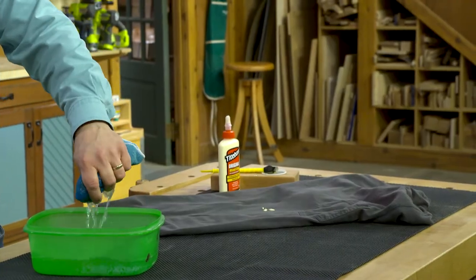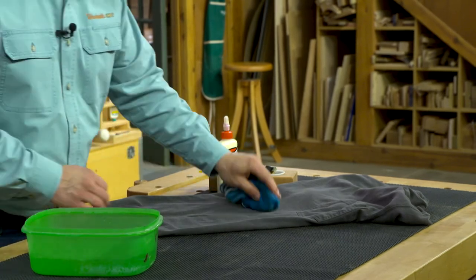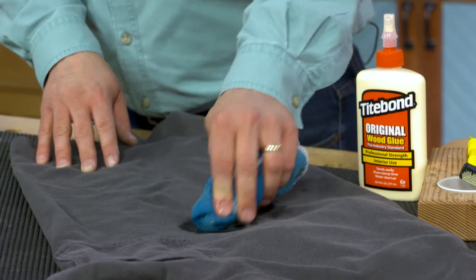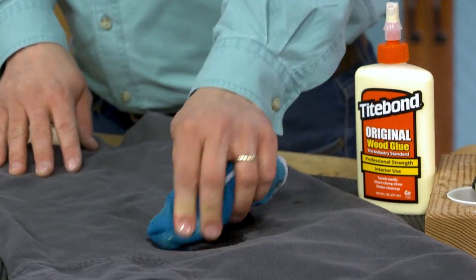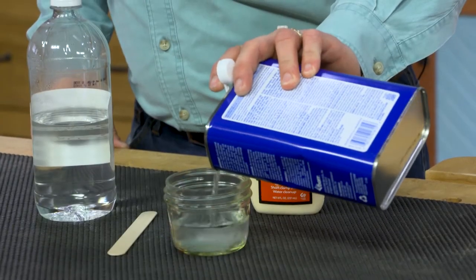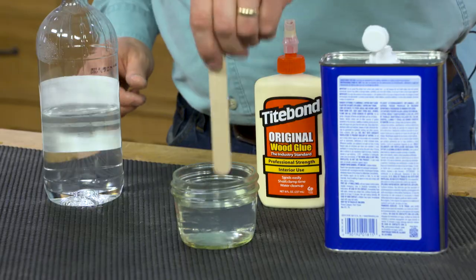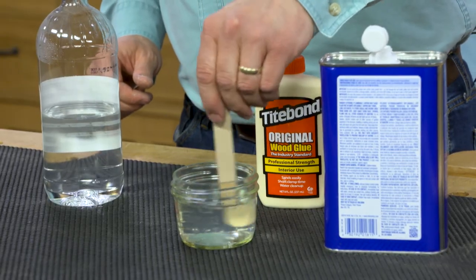If you had a little too much glue and now have it on your tools or yourself — if you get glue on your clothes, you want to keep them wet. That's why you want to have a bucket of water handy during the glue-up. If the glue has dried, a mixture of acetone, water, and vinegar will soften any of the water-based wood glues, and then they're easily scraped off. If it's real thick, you may need to repeat.